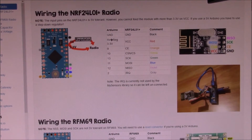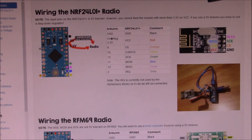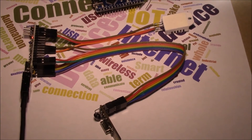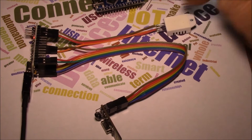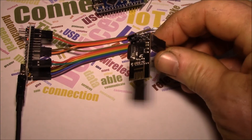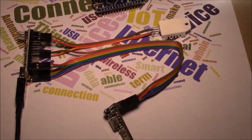You'll want to wire this up per the instructions on the MySensors site — I'll put a link in the video description. Note that they are showing the Pro Mini pinout, so be sure to have a Nano pinout for reference, or use the Pro Mini along with an FTDI USB to serial adapter. If you're using the Arduino Nano like I did, be sure to use the 3V3 pin, which is the 3.3 volt output for the radio power, since the Nano VCC pin is at 5 volts. Here's what the serial gateway should look like — you can ignore these 3 wires, I'll cover that in the next video. You have your radio, your Nano, the capacitor is soldered on to the radio, and that's the serial gateway.